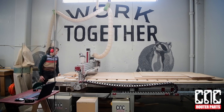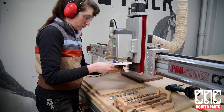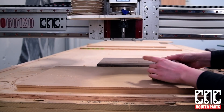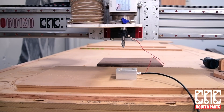After turning on the machine and referencing all homes in Mach to ensure that the gantries are aligned, I'd like to ensure that my material is also square to the gantry. To do this, I'll engrave a square pocket with dog bone fillets, roughly the size of the material. We can place the material in the pocket and snug it up to the front left corner, knowing that the pocket is square to the machine.